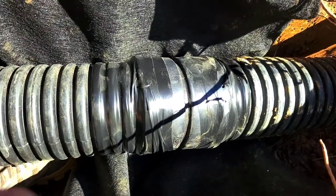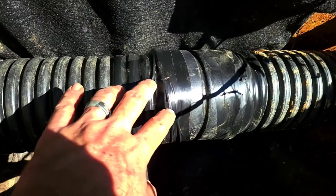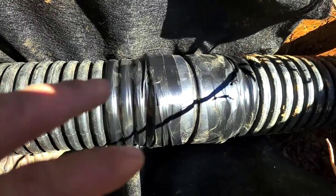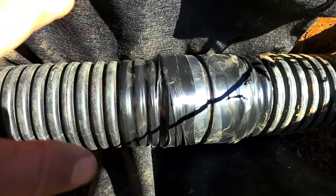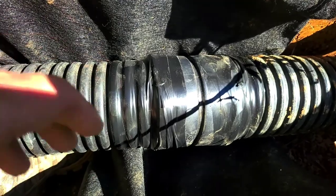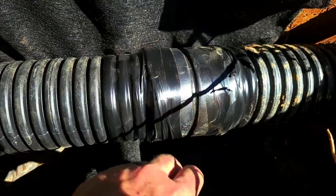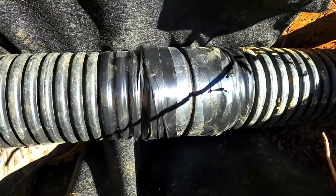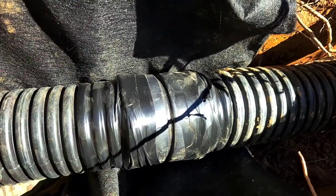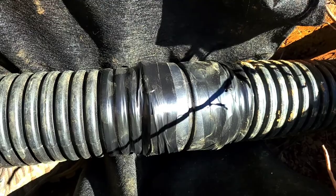We've connected our two pipes here and taped them. Technically you don't need to tape the perforated pipe to the coupler, however we think it's a good idea because when you're moving the pipe and adjusting it, if you don't have it tight and secure, it can come out and cause a lot of headaches. We recommend taping every single connection — on the solid side, making sure you keep roots and sediment out, and on the perforated side just to keep it together as you're moving it.